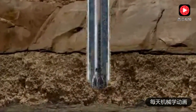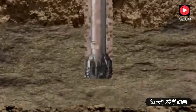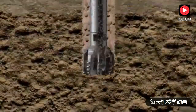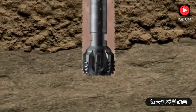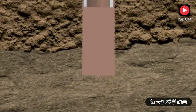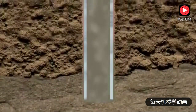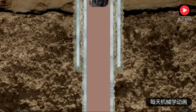With the riser in place, seawater is replaced by a special fluid known as drilling mud that is pumped down the string and exits through ports in the bit. The mud not only cools the bit but also clears the cuttings from the hole. The cuttings are captured at surface and examined by geologists to characterize the rock types being penetrated. As drilling continues, sets of decreasing diameter bits and casing runs are used as the well penetrates deeper into the rock. Each run of casing is cemented in place to provide integrity — a sealed system from top to bottom.